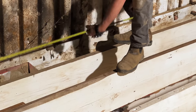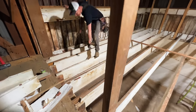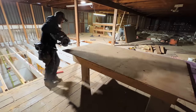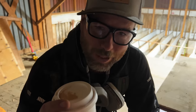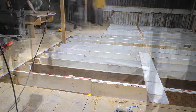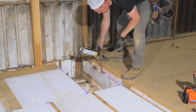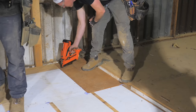The panels on the first row needed to be notched around the posts we'd installed previously, and we got our cut station set up using foam board as the cutting surface. We added Advantec subfloor adhesive to help the plywood stick permanently to the joists and attached the panels with two-and-three-eighths-inch ring shank framing nails. Installation was a little slow going since it was basically a scavenger hunt trying to find pieces the right length to fit each span in order to save on material. Eventually we got to the last piece and the sheathing was done.